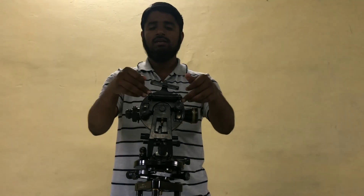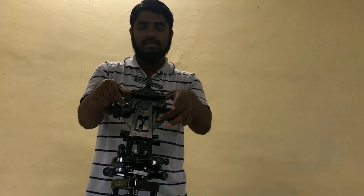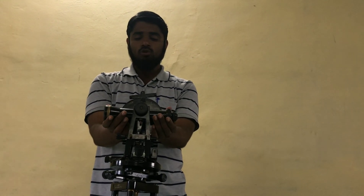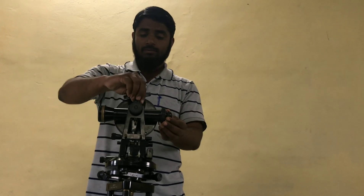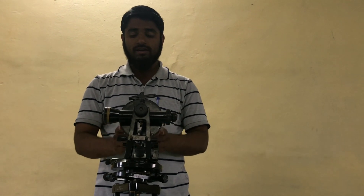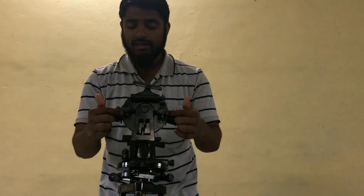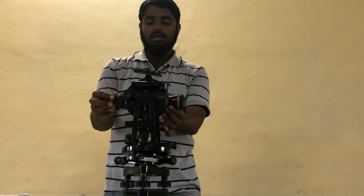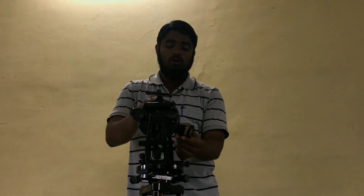Similarly, in the vertical circle there are two scales: the main scale in the outward direction and the vernier scale. The graduations are the same. But when the telescope is kept in the horizontal direction, the vertical angle should read 0 degrees. The vertical circle graduations are marked 0 to 90 and 0 to 90. When I turn the telescope upward, I will take the angle of elevation, and when turned downward, this is the angle of depression.